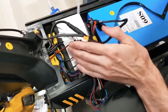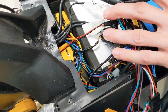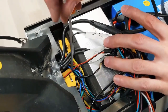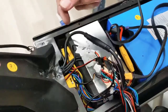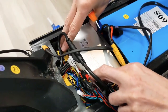Down below here, these two yellow plastic blocks are the two terminal blocks that have the phase wires for the two motors. Three phase wires for one motor, another set for the other motor. You'll have to pull those out, open that up, and disconnect those wires. Then you'll be ready to remove the controller.